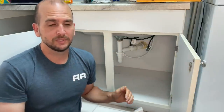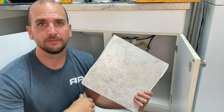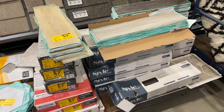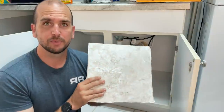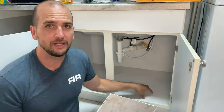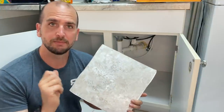Let's keep it simple. Keep the budget under five dollars — and what I'm going to use is just peel-and-stick floor tiles. Because I'm not looking for flooring in my dream home, I'm very flexible on tile type and I usually look for discount clearance tiles. For instance, this is an Armstrong product — pretty good product — two millimeters thick for 47 cents per tile or per square foot. I'll be able to get this done for about four dollars to line the whole cabinet with something that's going to be much more water resistant.